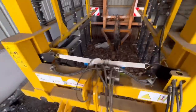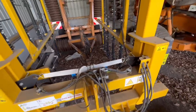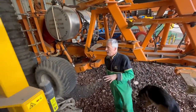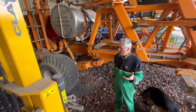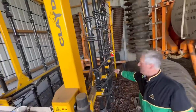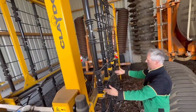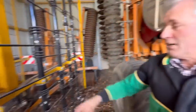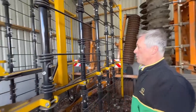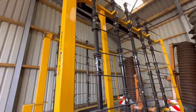It's also got a Claydon straw rake. They used it the first year but not last year, so it hasn't done a lot recently. Our straw rake tines are getting ready for replacement - they've worn down considerably and you lose your height and clearance when they get short.